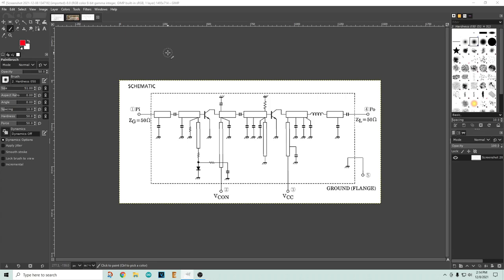This is the schematic of the Toshiba module. It also has two transistors, an output filter, and power coming in through an inductor to the collector of each transistor. These little squares denote inductors in a PCB layout. As we come into the module, the path goes through a capacitor and inductor, a capacitor and inductor, another capacitor, then into the first transistor. Out of the first stage there's an inductor, capacitor, and more inductors into the second transistor. You can see the two circuits are basically identical — there's very little difference between them, though the module does some RF magic on the PC board.